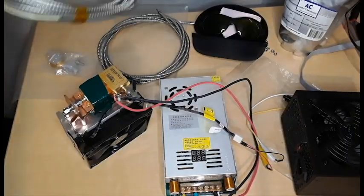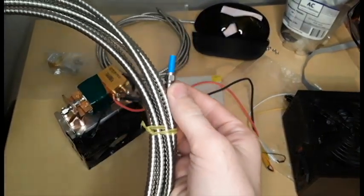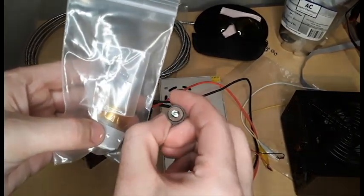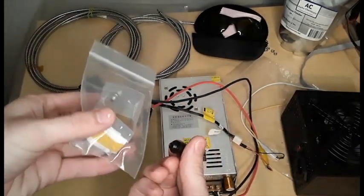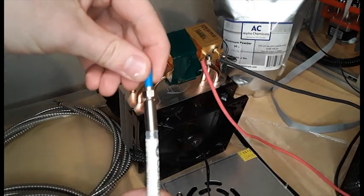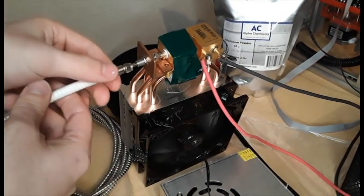You'll also want to look for a used fiber optic cable made by Coherent. This particular version is armored, meaning it's very difficult to break. These cables have an SMA connector which allows us to connect our accessories to our laser. You'll also want to look for a lens or collimator that is SMA compatible. The lens on the left was manufactured by Coherent and I purchased it used, while the lens on the right is Chinese and actually overheated and destroyed one of my cables because of its low quality. Don't touch the surface of any optics or the ends of your fiber optic cable with your bare hands, as doing so can damage them by leaving organic residue which will later cause the system to overheat.